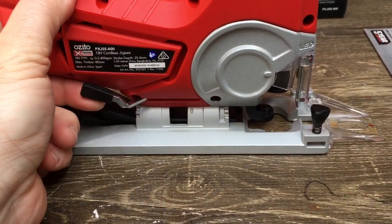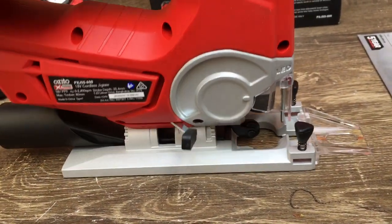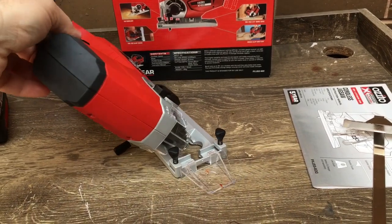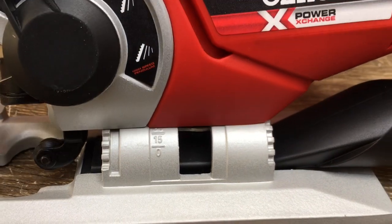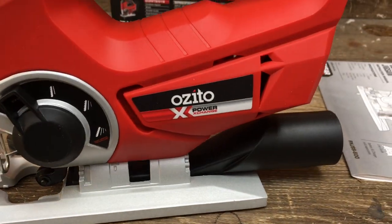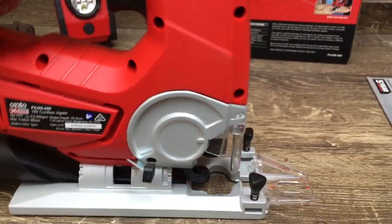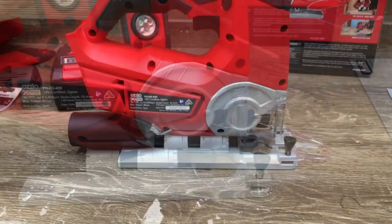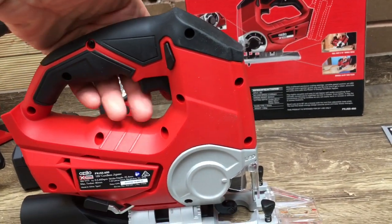There's a quick release bevel edge. First time using it I was trying to figure out how it worked, but you just slide the clamp off, slide it forward, and it gives you the option to go left and right. To get it back into position you push it back so it gets into a notch, then pull the clamp and it clamps back down again. It's a really good option, quite smooth - you can feel it flick across the notches and once you clamp it back it stands up nice and straight.